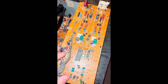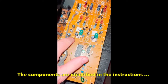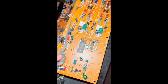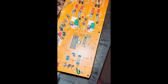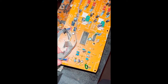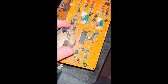Everything we're going to do is centered around connection CN201 right here. You've got a couple of jumpers here — plus five and negative five volts — that we're going to attach wires to. Down here we've got ground, we've got a mute jumper, and then finally there's pin six on this connection — that's your RF pin — we're going to attach a wire to that as well. So everything is localized right around connection CN201 in sections four, five, and six.